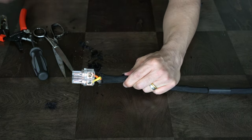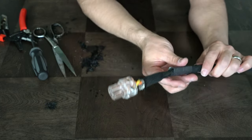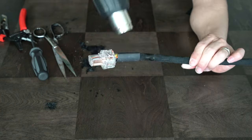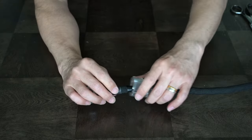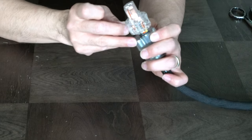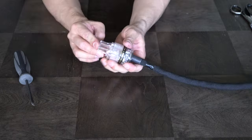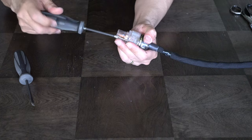Once you make the connections, twist everything again, then clean it up. I just finished trimming. Now I'm putting electrical tape here so nothing moves back out, then I slide the dual-layer shrink tubing on and shrink it down. Now we slide the outer cap on and we're good to go. I'm trying to put the plastic retainer back in — it's going to be super tight, but it can work without it. I just like to have it in there so the cable stays centered. Now we screw it back down.